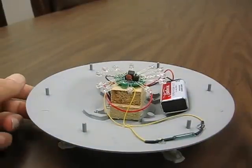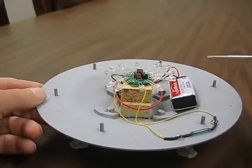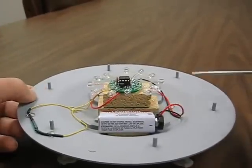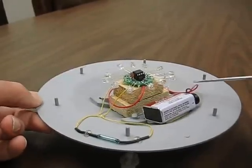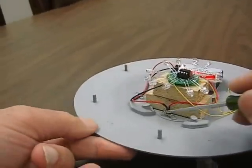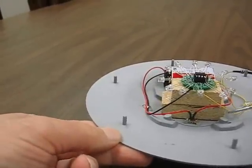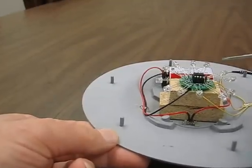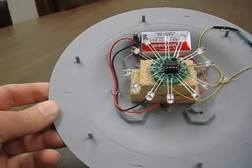I just wanted to point out a little about this board. This lighting kit is pretty much self-contained. We have a 9-volt battery here with a clip. It's all going to come pre-wired for you — all these wires to the magnetic switch, to the 9-volt battery clip, and to the on/off switch will be wired to the board. The only thing you have to do is supply some sort of standoff from the base to the top, about an inch and a half in height, and then hot glue the board in place right in the center. It stays nice and locked into place.